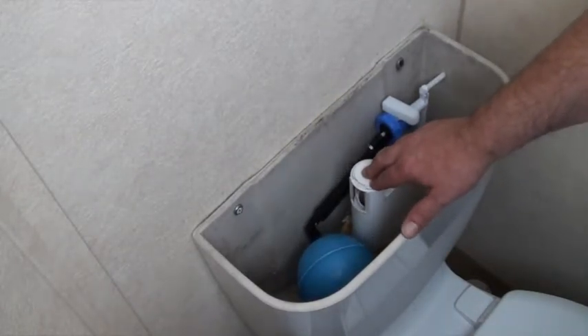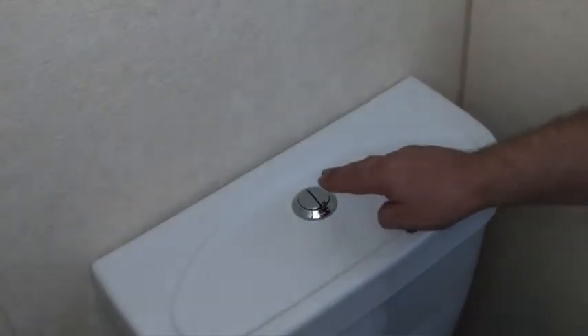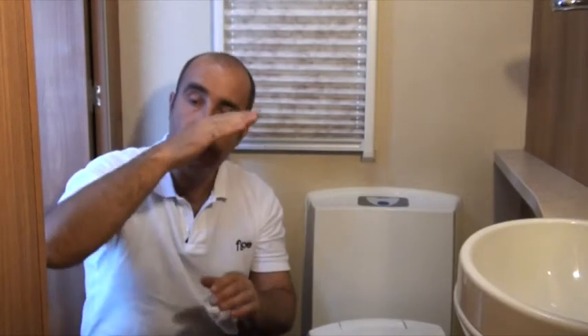The third kind of toilet is a domestic sort of toilet. The first two cassette types you'll find in RVs, touring caravans, and boats. However, the third domestic kind you'll only find on boats, and these are very uncommon now because the effluent actually comes out of the side of the boat. To drain it, don't flush it until the very end of the drain down procedure. Simply lift off the cistern lid — you'll see a ball cock or float that drops. Push the ball cock down, which opens the valve and draws the water through; the air will push the water through the mechanism and into the cistern itself. Only at the end of the entire drain down would you actually flush that toilet.